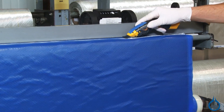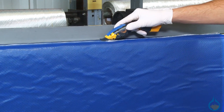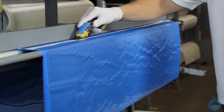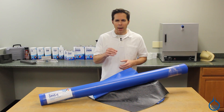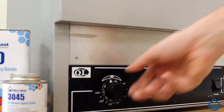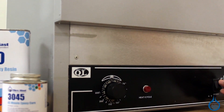In fact, our room temp pre-pregs have proven to maintain their properties as well as, if not better than, those that have been frozen. When it comes to curing, pre-pregs need heat and pressure. So at bare minimum, you'll need a reliable heat source like an oven or an autoclave and vacuum bagging materials.